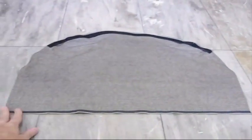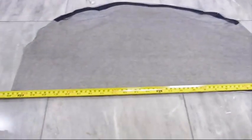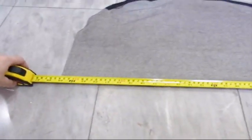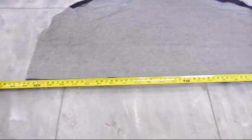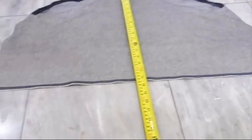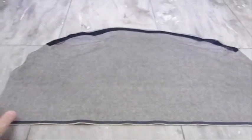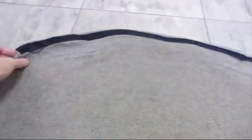Here's the cloth part. It is 64 centimeters this way and 44 centimeters that way, which is roughly 25 inches by 17 inches — though it will probably vary with different masks. I cut this curve based on my helmet; I literally just wrapped it inside my helmet where I wanted it to go and marked it with my soapstone and cut it.